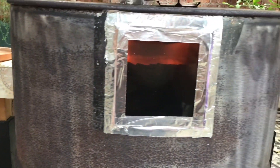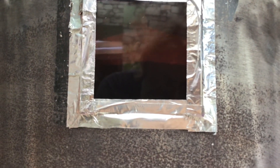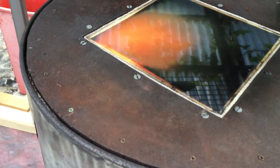It definitely seems to make a difference with the vortex. The fire's been burning for about 15 minutes and the flames are quite clearly coming out the top of the riser — something that didn't happen without the vortex piece in place. I just took another reading: over 500 degrees C, which is over 1000 Fahrenheit. You can see the flames hitting the glass on top, and the vortex makes a considerable difference — it seems to make the flames leap out of the riser.